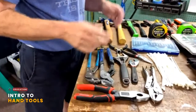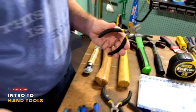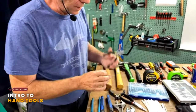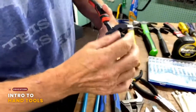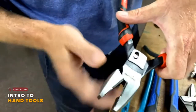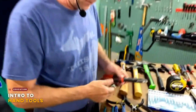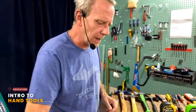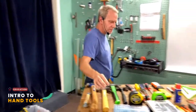The other is, I'm going to say, side cutters. So these are side cutters. Again, this is a very small one. Generally, these side cutters are this size, right? But these little side cutters like this are nice. But you can buy a tool, what we call linesman pliers sometimes, with this flat nose on them. It's got a pair you can grab on with, but it also has a pair of cutters on the side. So some of these hand tools are dual purpose. So, do you really need one of these if you have something like this with a pair of cutters on the side? Not really. So sometimes you're going to be able to combine those tools depending on where you find them. So like I said, a pair of pliers, stuff like that.